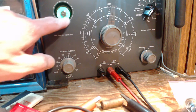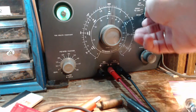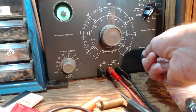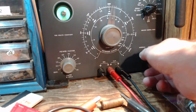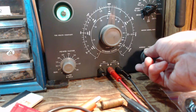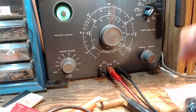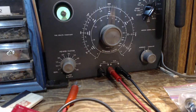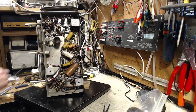Looking to see the gap in here — I know it's very hard to see on camera. 25-volt test. Oh my gosh, I didn't test — I've got a hundred bucks at risk on this. Here we go — 150. Okay, not quite as bad as I thought, but no good at any kind of voltage really. At 25 volts, no reason to measure its value — it's leaking like that. So there we go, 0.01.